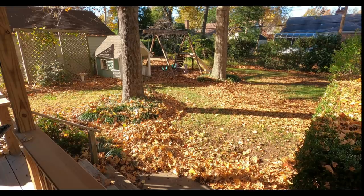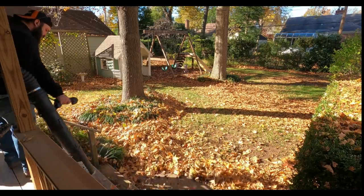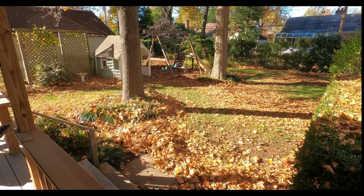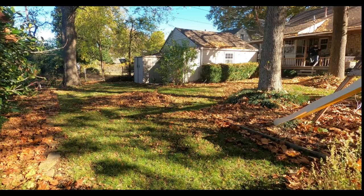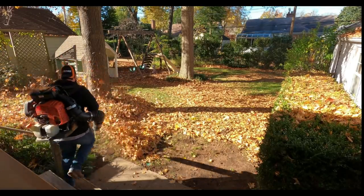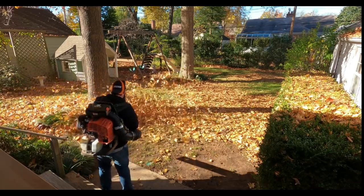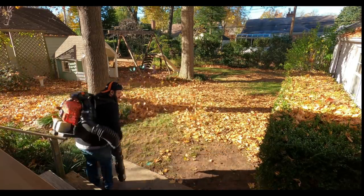Since I had to pull my zero turn off, I went ahead and did that. We're getting ready to use the blowers and start cleaning. I've worked my way onto the porch, coming in on the narrow side where that gate was. The first thing: start from top to bottom. If you're going to clean gutters, start at the top — blow the roof line and ridges. If you're not doing gutters, start with the porches and top of the bushes. Otherwise you'll clean the yard and then realize you missed the top of the bushes and make a mess where you already cleaned.